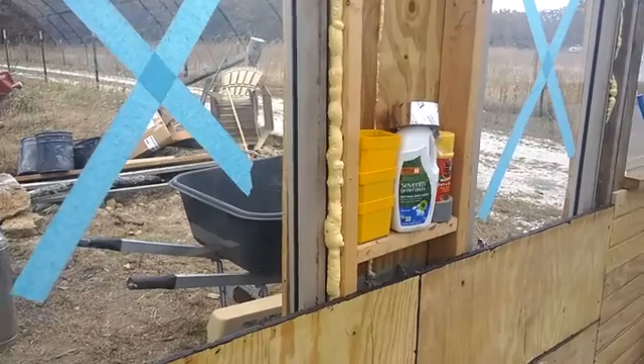The number one rule of alternative homes is: look out the window, what do you see, build with it. Looking out the window in a war-torn country, you have lots of barbed wire and lots of sandbags. So he's like: the barbed wire is the mortar, the sandbags or rice bags are the building material — you pack them. It's a free-formed rammed earth. Anytime you pack earth, it becomes like rock. Earthbag is a free-form rammed earth where you can ring it around in any form you want. Compressed earth blocks — CEB — is machine-rammed earth. And then you have earthship, where you're packing dirt in tires — same thing, that's rammed earth. About 80% sand, 20% clay is your standard mix for any kind of rammed earth building system.